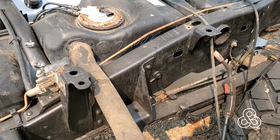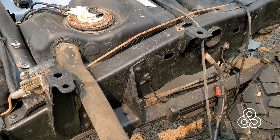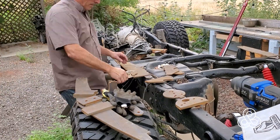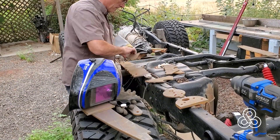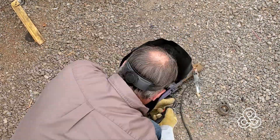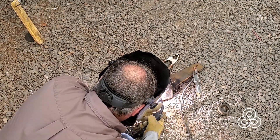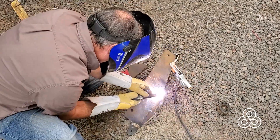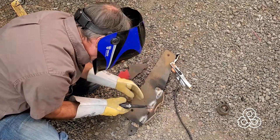The subframe is going to be mounted with a three-point system and I'm going to use these mounting points on the chassis that originally held the pickup bed, building some brackets that are going to hold a piece of heavy tubing that goes across. This three-point pivot will pivot laterally in the back, then there'll be two others that pivot perpendicular to that. This one is made up of brackets that are going to mount to our original chassis mounts with the tube that crosses.